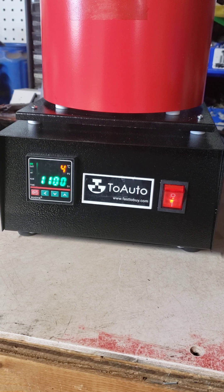And there you go — the 4H code is gone and it will start raising in temperature here shortly. If you're getting one of these units in, I don't think it's really a manufacturing error — I think it has more to do with shipping and how far these things have to travel to get to us. The wires just came loose and it's an easy thing to check. So if you get this furnace, you've been waiting for it, you're excited to use it, and you turn it on and you get those 4H's — don't panic. It's at most six screws that you've got to deal with, get those wires secured back up, and you'll be melting in no time. Thanks for watching, hope this helps.